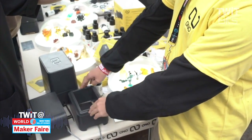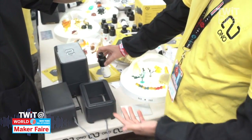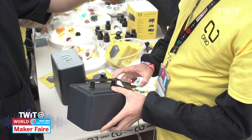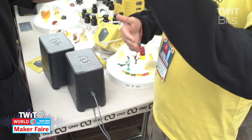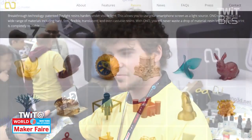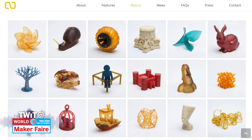You put the top on, and here you have the resin tank with a clear film on the bottom, which protects your phone from coming into contact with the resin. You take your resin, pour it into the container, and when you close the printer it will automatically start printing. The platform will go down, the phone will show the first white image to harden the resin, then the platform raises and shows the next image, and so on until you end up with the fully 3D printed part.